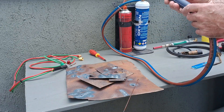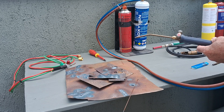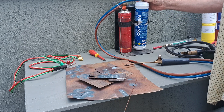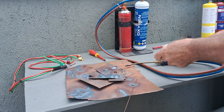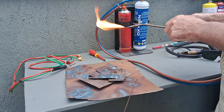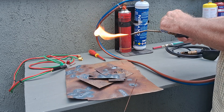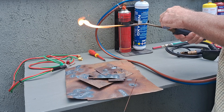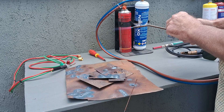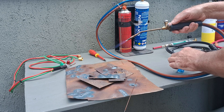While we're here I've got the little Kemper gas welding bottles out, and this is the Walkover 555. While we've got it out I'm just going to show you the flame off this as well. It's a nice little kit to be honest — when I put a bigger nozzle in the torch it became a lot more capable, so it's very important to get the right nozzle. That's a beautiful little flame — that's a butane and propane mix with oxygen out of the cylinder.